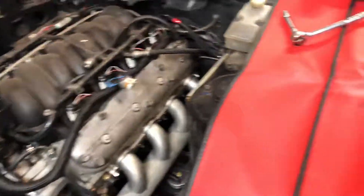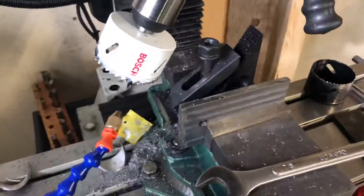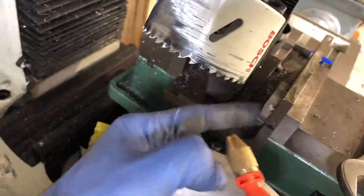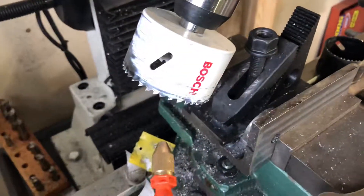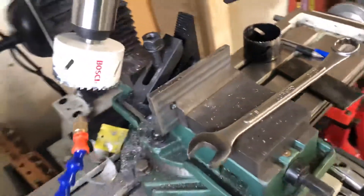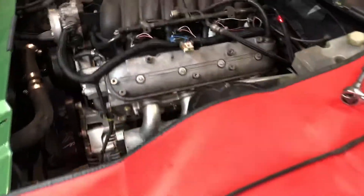I made a little jig for my mill to cut them at the angle — it just sits in here on this locator, and there's a toe clamp for the mill that holds it in place. Works really well, you just have to go really slow with stainless.